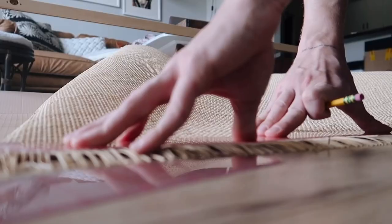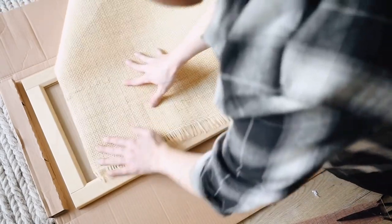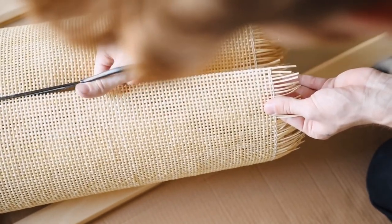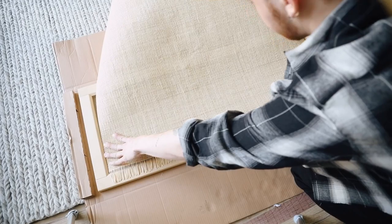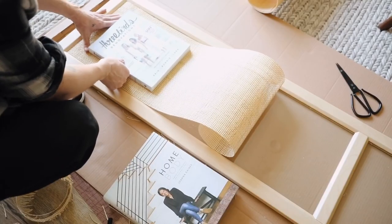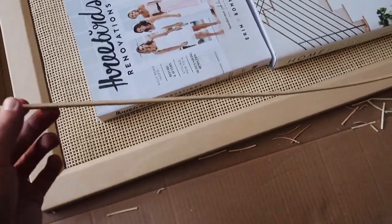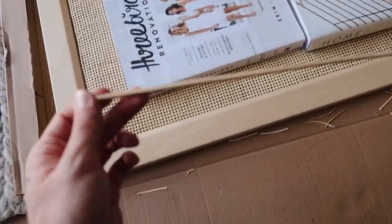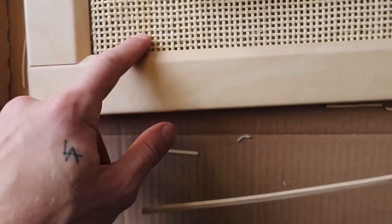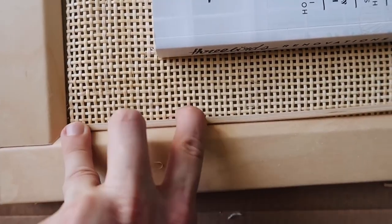I started by measuring the inset of the glass door with a ruler. The glass window panel is 11 and 7/8 by 35 and 3/4 inches — that's exactly what I needed to cut from the rattan. The great thing about the crosshatch pattern is it's essentially on a grid, so once you find your first line you can follow it all the way down for a perfectly straight cut. I cut my first panel, confirmed it fit perfectly in the inset, and laid books on top to hold it. The long coiled wood sticks I picked up are for finishing the inside edge — I'll apply epoxy glue along the edge and sandwich this wood trim on top all the way around.